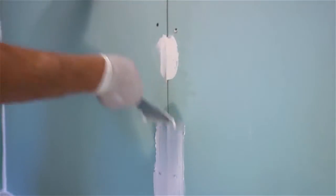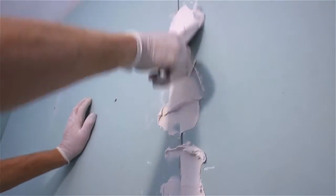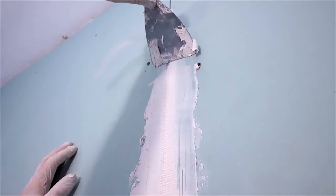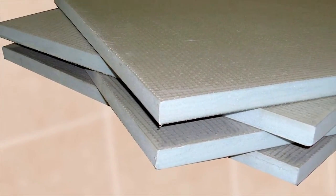If you have joints in the plasterboard or different surfaces such as plasterboard joining masonry, it's a good idea to apply some glass fiber reinforcing scrim to the surface — this can be stuck with the tile adhesive. We're using moisture-resistant plasterboard, which is recommended for bath and shower rooms. An even more durable product is a tile backer board.